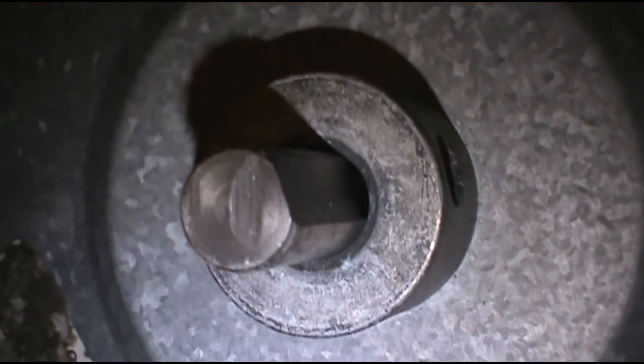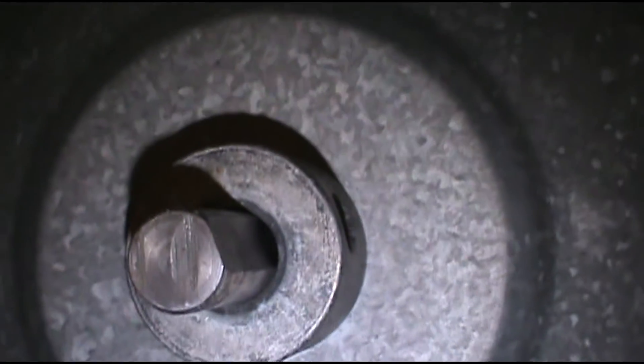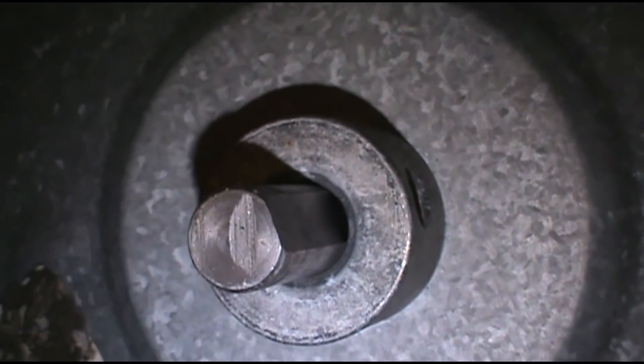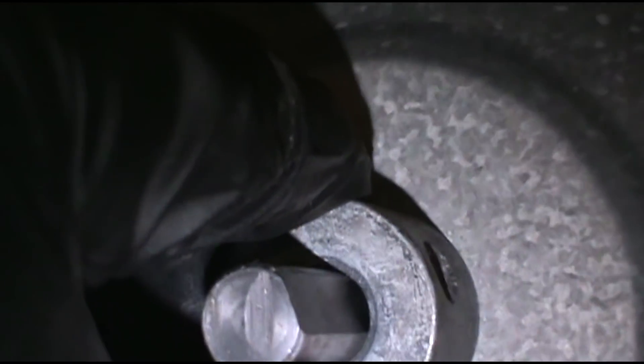Alright. When you tighten it back down, you want this screw to go on the flat part - don't put it on the round part, or the resident's going to get a nice surprise. That's why it's at 2:30 in the morning when it's squealing and off the hinge. So yeah, make sure you just put it on the flat part, line it up with the flat part, tighten it down.